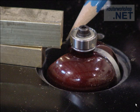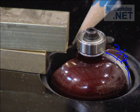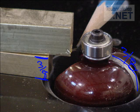We use brass setup bars. Now, what the radius is of this cove here is 3/8 of an inch. And how we find out where the position is to match so that it's symmetrical is we're using a 3/8 inch spacer bar, and we've put another one over top of it, which is going to touch right on the edge of the upward position. So when we move this up in position, we're making sure that this is all 3/8 of an inch across. Makes it easy to set up very quickly.